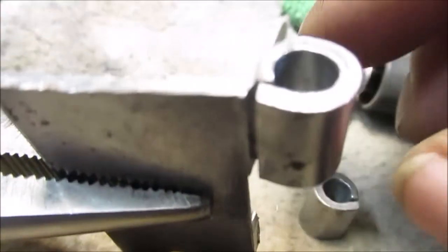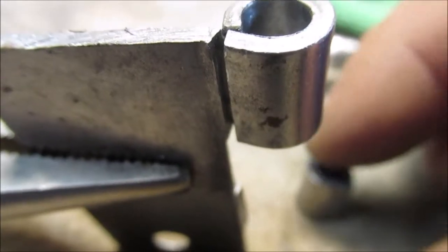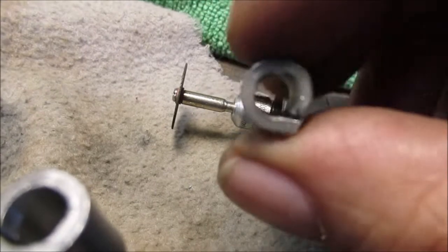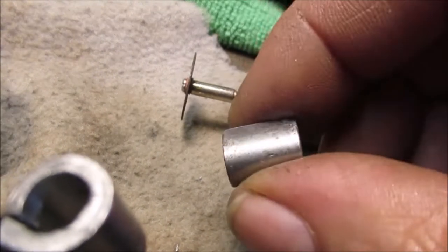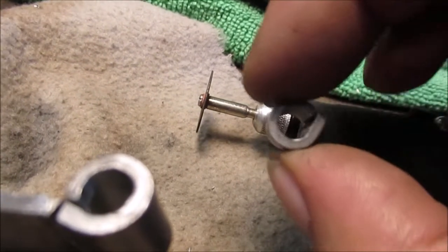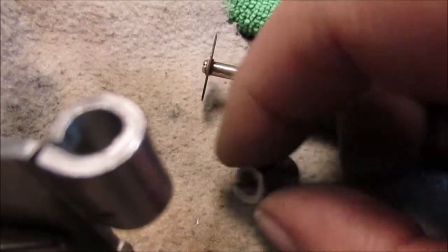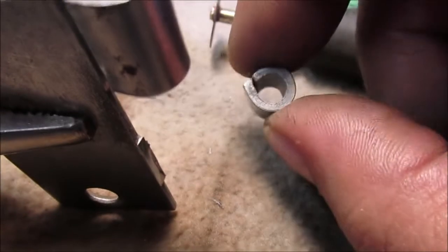That gives your gap to bend back. With a little bit of grinding I got me a couple of bushings. Who'd ever think of that? If you need some bushings and can't find anything, go into the hardware store, find those cheap door hinges. If you don't care about having a seam, you can always make stuff out of scrap.